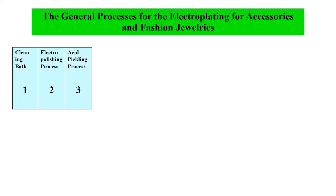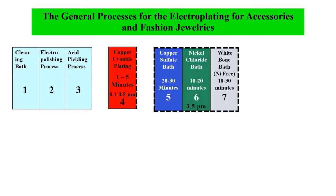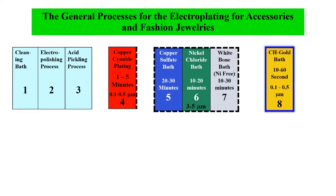The most important process is cleaning, so you must clean your object before you start electroplating. First, the electroplating is copper cyanide plating — a very thin layer — giving the adhesion between your object and the following electroplating. The second is copper sulfate plating or nickel chloride plating, giving a thickness of 3 to 5 micrometers and giving a shiny finish to your electroplating.